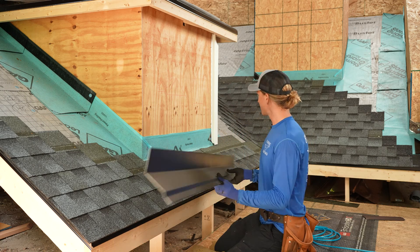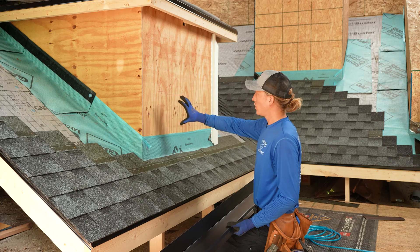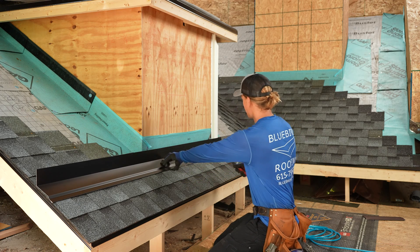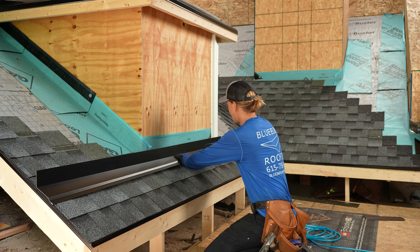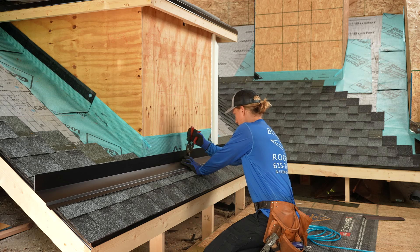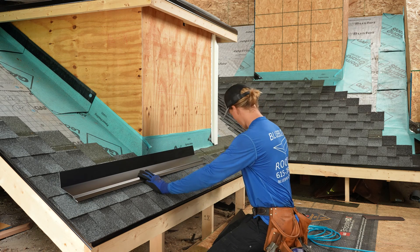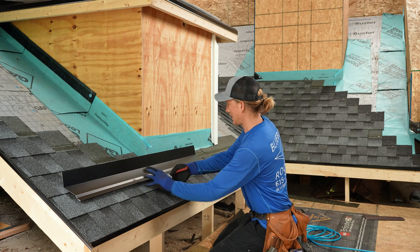Here is our apron flashing, and I have simulated that this wall would have vinyl siding. I'm going to give myself about four inches past over there and I'm going to teach you the art of splicing your apron flashing, which is critical to ensure that you get your apron flashing on these dormers to where it looks good and it's fast. I'm going to bring it past where I just cut it about six inches for my lap in the center.